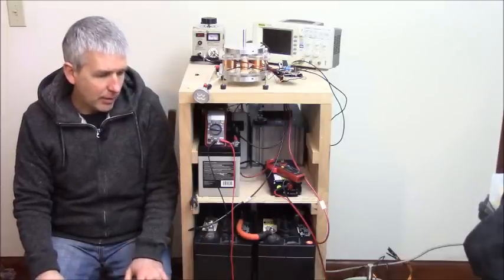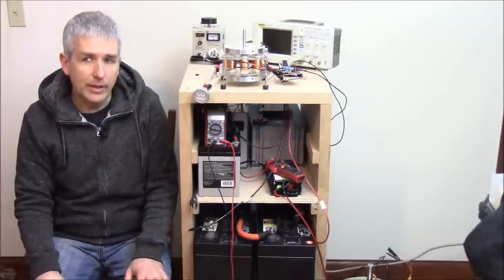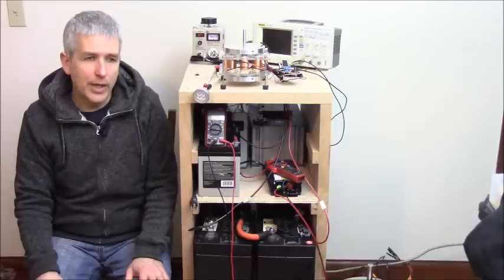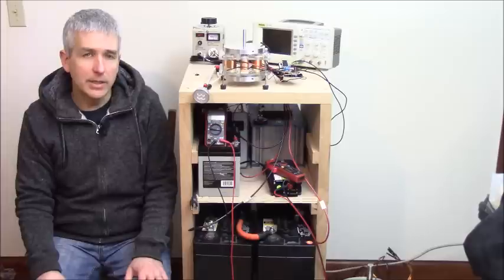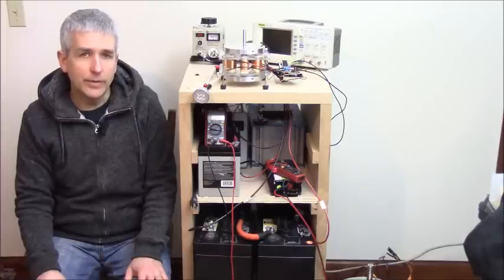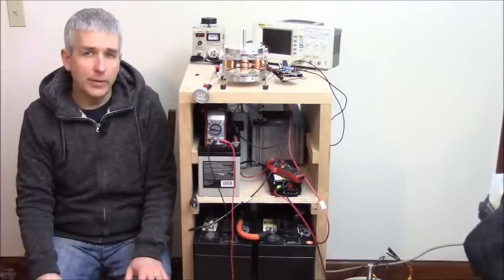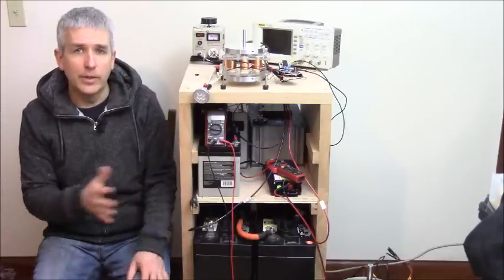But usually, when you're trying to pulse a battery, this is what I've always said: you can't do this. I've done it over time, but when you try and charge a battery that's powering a motor, it is a very inefficient process because the battery doesn't like to go in two different directions. So you're not going to get the benefits of regular pulse charging, which takes advantage of a rest period, because during the rest period you're pulsing the other way and you're really doing damage to the plate.